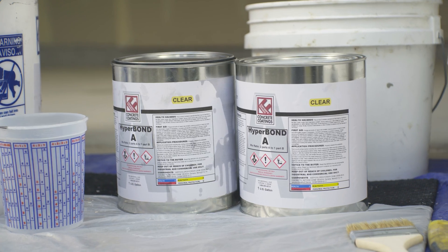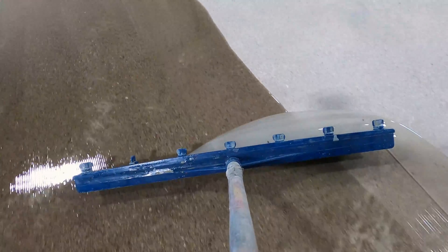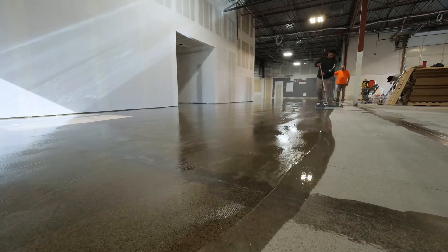If your reading comes in over five pounds, you don't want to apply just any coating — avoid polyaspartics and most standard epoxies. The epoxies we have for sale, including Hyperbond, are good up to eight pounds. If you get a reading over that, there are specialized epoxy primers good up to 20 or even 25 pounds. For readings around 20 pounds, apply the coating at the proper thickness — around 16 mils, which equates to about 100 square feet per gallon. Contact us if you need access to those specialized primers. We also have floor coating application videos linked in the description.